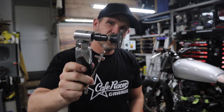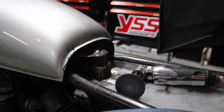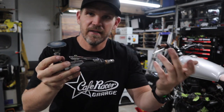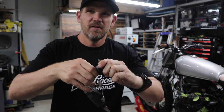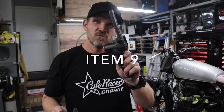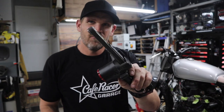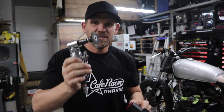The next item is not for everybody unless you've got an air compressor — it's the 90-degree die grinder. These things are fantastic because you can get into some places you just can't reach with anything else. You can get different pads: sanding discs as well as Scotch-Brite linishing pads, which just screw on really fast. I also use an air file, which once again needs an air compressor. I probably use the air file more often, but it all depends on what you're doing — I'd highly recommend both.